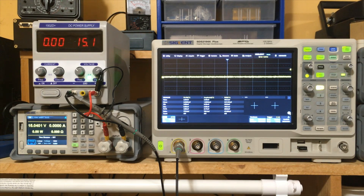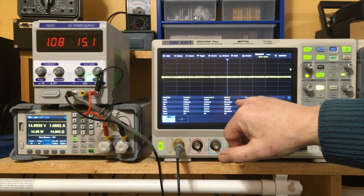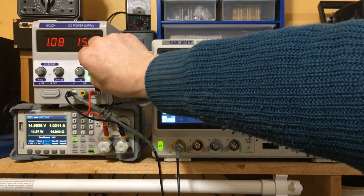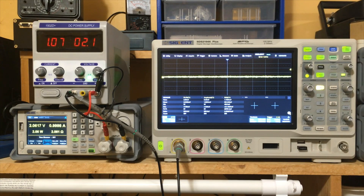That's pretty good so far. Let's check the noise with a 50-ohm load on it. It's rated at two amps so let's do a one-amp load. We're pushing one amp at 15 volts and we're still running about three millivolts peak-to-peak — it's added basically no noise. There's a little bit of increase on the RMS, roughly 50 microvolts. Reducing the voltage down to half: still 2.9 millivolts peak-to-peak and about 600 microvolts RMS — about 50 microvolts of noise added while running at about half load. Let's bring it all the way down to the lowest voltage, 2.1 volts.